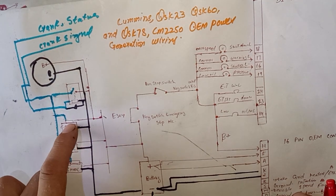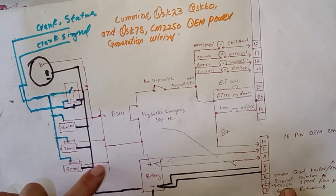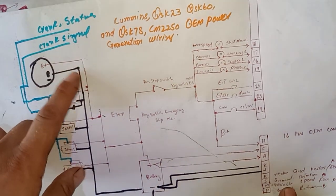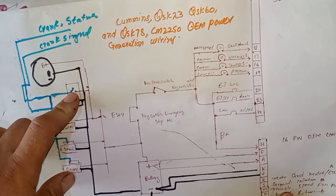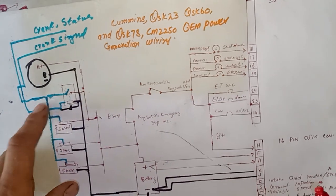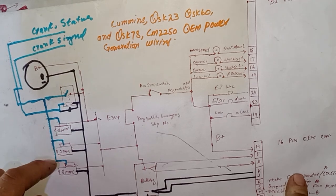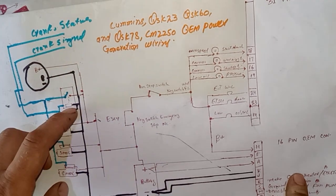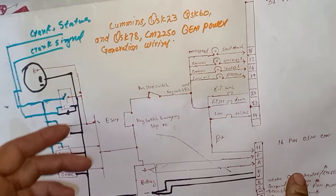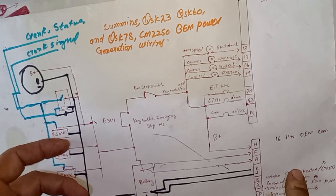When the switch is turned on and the cranking signal is sent to the slave relay, the relay energizes, takes supply from battery positive, and sends it back to all starter motor S terminals. The engine turns over. Battery positive feeds the solenoid of all two or three starters. Whether you have one, two, or three starters, the operation is the same.